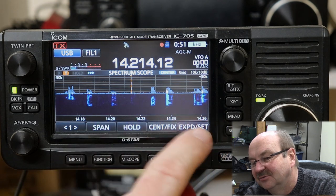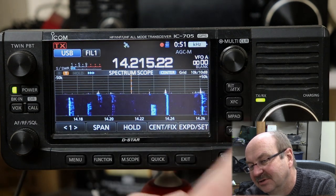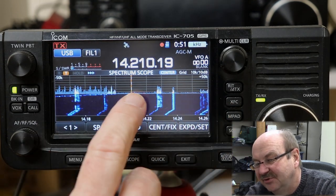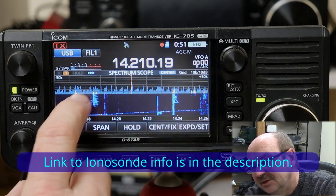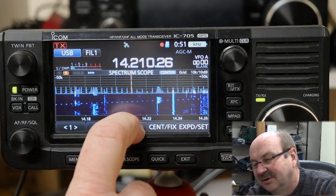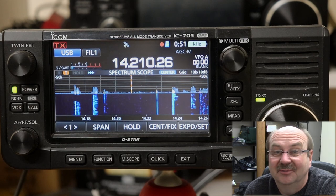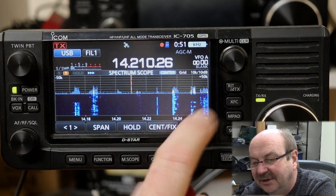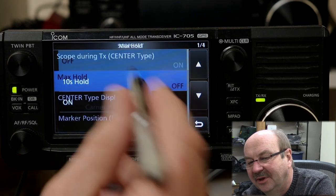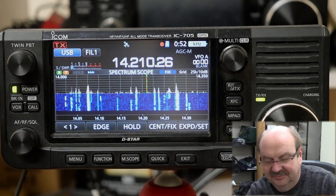Also in center mode, if you change frequencies, because that's going to move everything, moving clears it as well. So if you like the max hold feature, all you've got to do in center mode is just move your frequency to clear it, or press and hold that hold button. I just wanted to go over that and make sure I covered it from last time. Now I'm going to go back in and turn that back off, just because I prefer it that way, and for the purposes of what we're going to be looking at, having it off is fine.